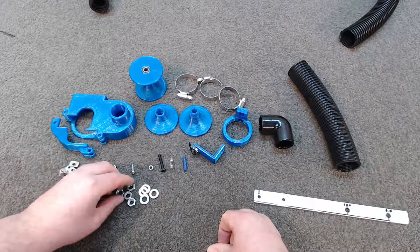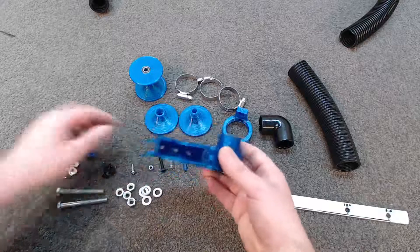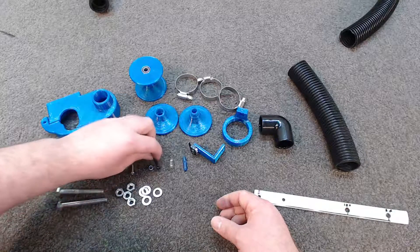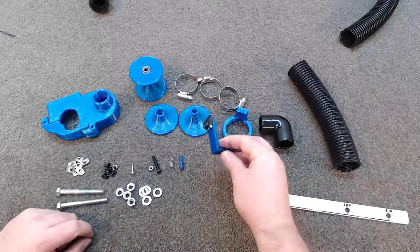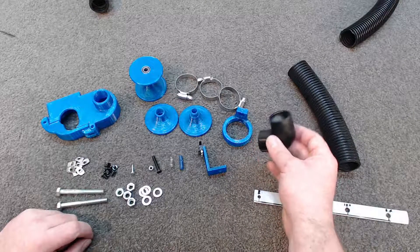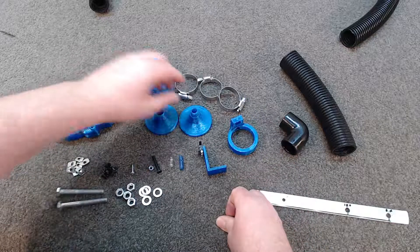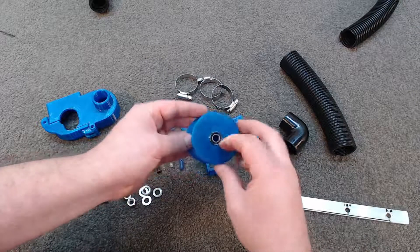We have M8 bolts, nuts, and washers. We've got a variety of 3D printed components — this is the vacuum nozzle for the vacuum system itself, and we've got a door which goes on there. We've got some T-nuts, some low profile 8mm cap screws, a pan head screw, another low profile cap screw, a spring, and a 3D printed pin. We're going to need an extended switch mount because we are going to be limiting the amount of travel on the X-axis. This is a PVC elbow — it fits just snugly inside the 32mm vacuum hose and I've just painted it black so it matches. We've also got another 3D printed component that helps hold the hose in place, some hose clamps, and we need to print two of these guide rollers.